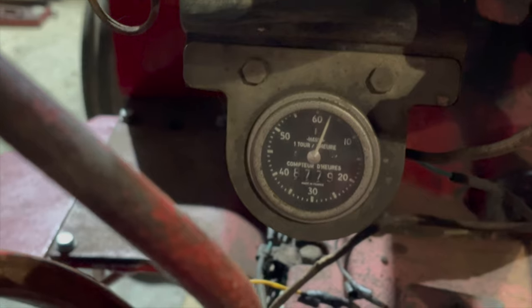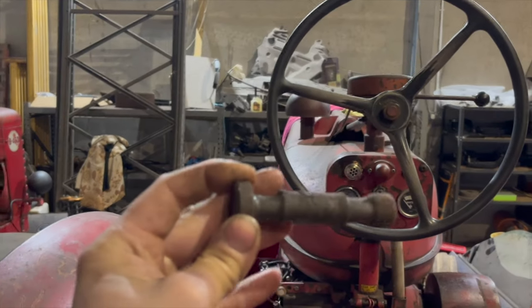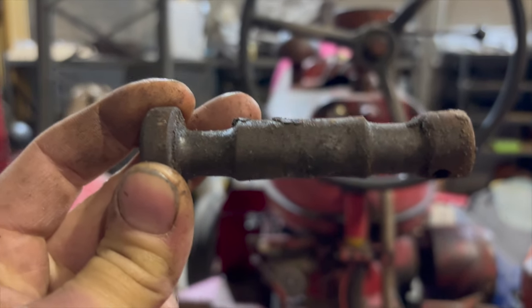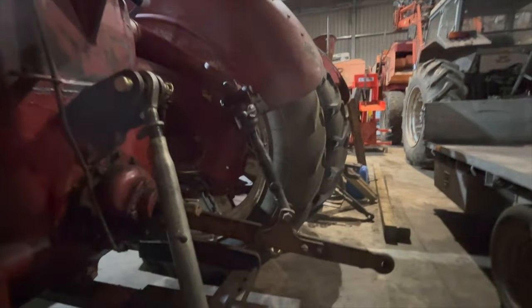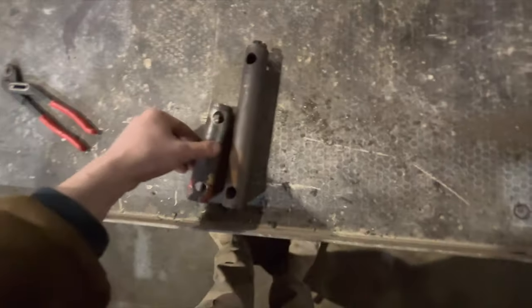It was mentioned in another video that this Farmall's done about 8,000 hours, which is what it does to your pins on your hydraulics — that's fairly worn. May need a fresh pin for this back end. Look at the difference that has made from putting the short one on the winding arm — that's fully wound up his arm now. Look at that, it's about kissing the floor. Should we change the other one? There's a lot of difference — struggling to lift it up now.